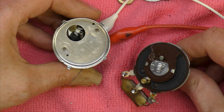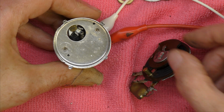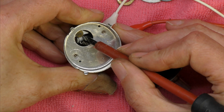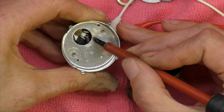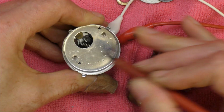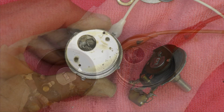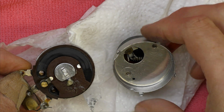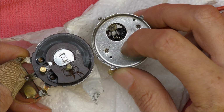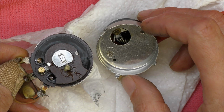Well, here's the pot in 2 pieces. See, there's a little piece of metal there that knocks this switch into position. Probably not the best way to operate it, but my goodness, that's stiff. So it's the usual spring mechanism, so I don't really fancy taking that apart, but I might have to. Well, I'd rather not take the whole thing apart, but I've re-lubricated the switch part, and I've sprayed some cleaner in here, and it seems much easier now, so we'll reassemble it and see if it works the right way round.